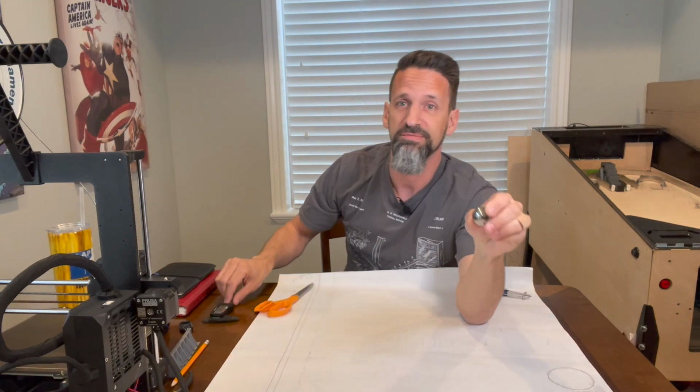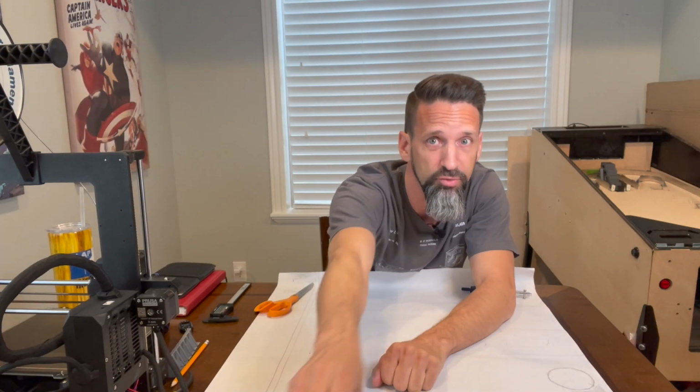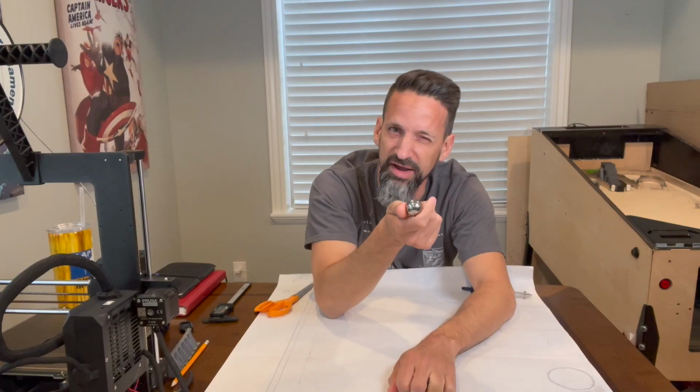Now, if it's just a target, a drop target or a stand-up, it can be that size. There are even some mini targets that are even smaller, where you have to be really precise to hit. That's fine, because the ball is just going to come right back. But if you have a lane you want the ball to roll through, an orbit you want it to go around, or a ramp you want it to go up, you need to make sure there's room for the ball to go through. The standard size for most shots is around 40 to 50 millimeters. Say 45 is kind of the average.